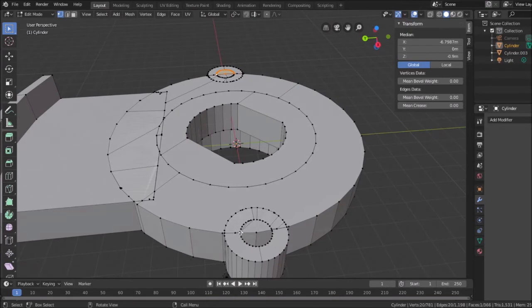So, do this on this side. Once you have the face in place, it then becomes a solid object. However, they call these solid objects with no odd holes in them a manifold object. That's the term. When I get all this done through this complex Boolean operation, which creates all these weird issues, and I load it up into a 3D slicer program and it says it's not manifold, either the 3D slicer will fix that for me, or I can load it to a site online which will fix all that stuff and make it a manifold. Because if the slicer cannot find where a solid volume is, it's not going to be able to do its job to slice it into the layers that it needs to do a 3D print.